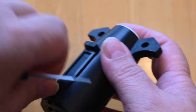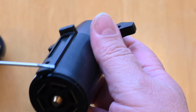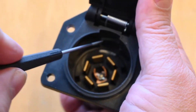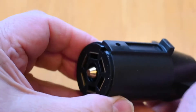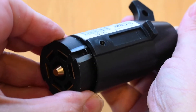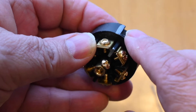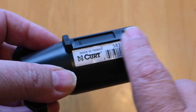What I like to do is take the connector and unscrew the top. The only alignment mark is the slot here — we'll call this a keyway. That slot actually mates with the slot in the housing. When I push the connector out, I mark where that is with a Sharpie, because when you open this up on the back side you'll see index marks and you're not going to be able to remember which is which. So mark it as you take it out of the connector housing, aligning with the keyway.